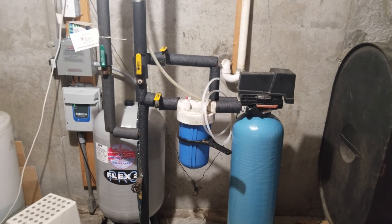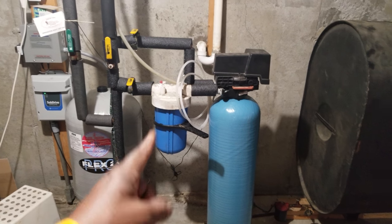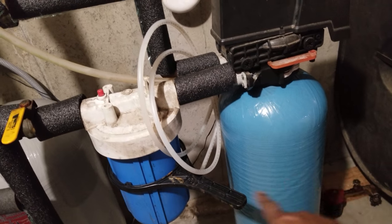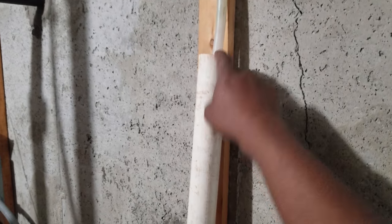Recently my water softener — you can see the tank here — and the Whole House pre-filter kind of shot. It's old. What it does is regenerate the water using salt from the brine tank, cleanse it in this chamber, then discharge back into the main line going to the house. When it washes the media, the water drains out into the dry well. For some reason it was clogged, the water would seep through and overflow, and one day I came down to water all over the basement.